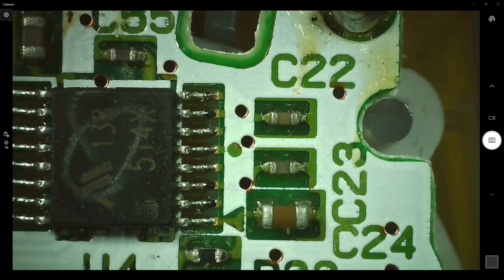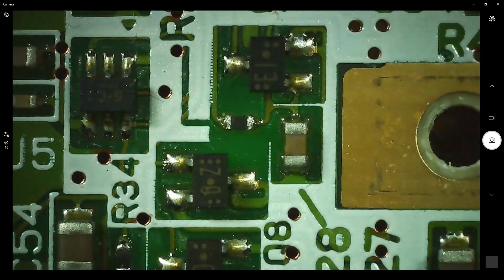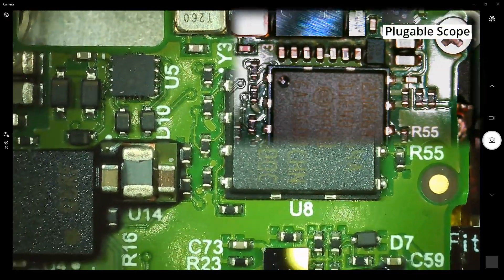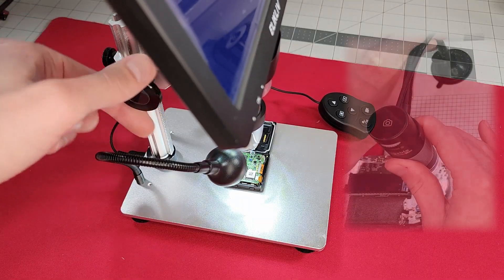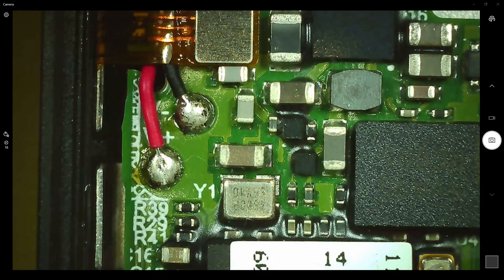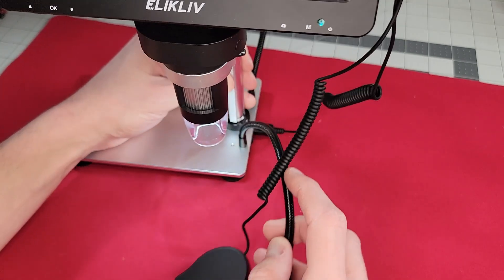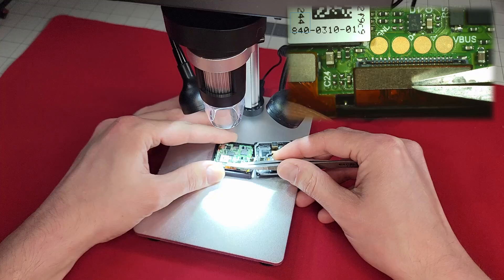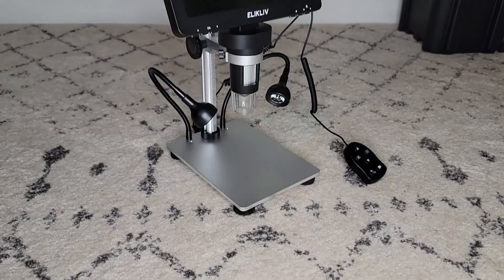Unfortunately, the scope could only record 1080p to an SD card, and when connected to a PC like you see here, it's limited to 720p. In spite of that, I was getting a better picture than the last scope, simply by having more freedom to adjust the lighting amount and angle. Looking at smaller components showed the most drastic improvement over the first two scopes — the picture was much more clear and less washed out, and again I attributed this to the improved lighting. Height adjustment was much easier than before, and the scope is always held at a bird's eye view, so it never ends up aiming at some arbitrary angle, which was a problem on both previous scopes. The max field of view was slightly less than the last scope, and the baseplate was a little too small when working with larger objects. I was able to improve both issues simply by rotating the scope to the opposite side of the plate to aim it at my regular work surface. Overall, this is definitely the best scope of the three, but not without its caveats. So nothing too shocking here — spending more money gets you better stuff. I think I'll be testing this one out further in future repairs.